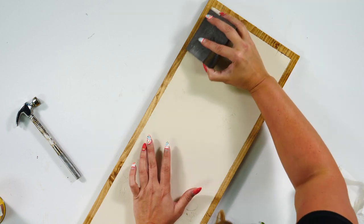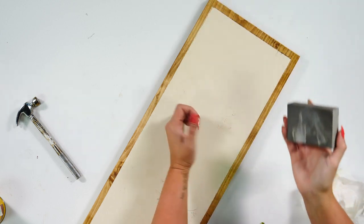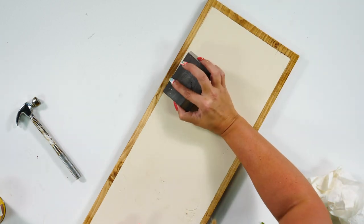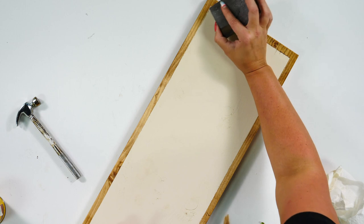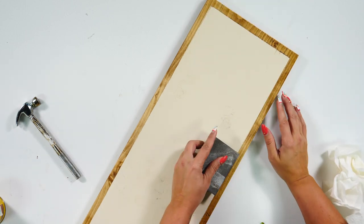One thing I want to make sure you are careful about, especially with this white layer, is trying your best not to get fingerprints on it — as you can see I was not paying attention and got my fingerprints on it, which I can kind of buff out. If you have to, you can come in with a sanding block and just kind of buff it out. Now that we have that, we're going to pull up our edge. If the stain for some reason gets in the grain and gets on your lighter layer, what you can do is go in and touch it up a little bit, or bring in your paint and do fine touch up work — it really depends on how precise you want to get.